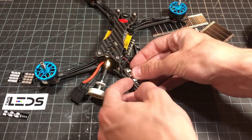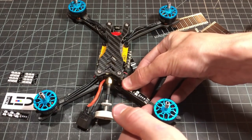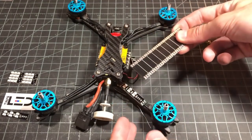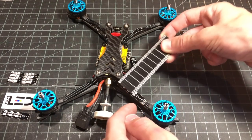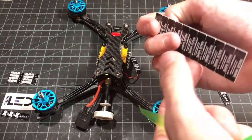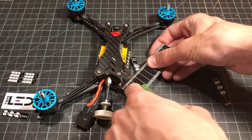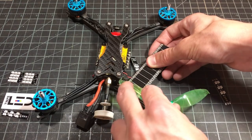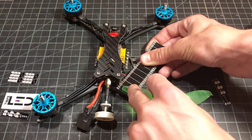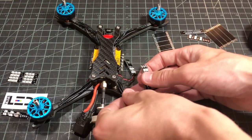We size this up on the quad to get an idea of where we'll need to cut our motor wires. The full-size version is a bit long and will leave your motor wires really short - I'm not a giant fan of that, which is why I think the race wire mini is a much more appropriate option as it'll leave more length on your motor wires. If you're just using the bare race wire without race lights, you wire them directly in line. You do need to insulate the bottom - it says right on the board, just a little bit of sticky tape between the carbon. Take your prop and bend the tip down to see where it strikes so you make sure you cover that area.